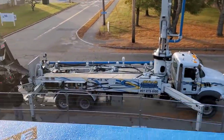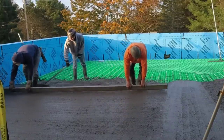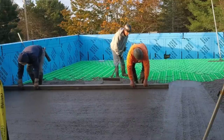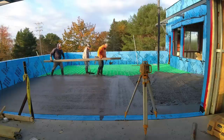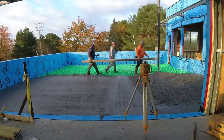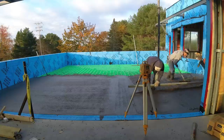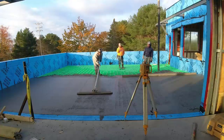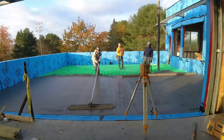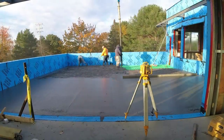This building is going to be for cloud storage — something to do with internet and storing data. This must be some type of outside patio for the people to relax on or get their lunch and sit. That's about as far as I know — we just get hired to come in and pour and stamp the concrete, we don't get too many details. Right now we're getting the first truck dumped out, that was five and a half yards. It takes about three quarters of a yard just to fill the pump hopper and all the pipe.